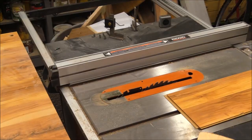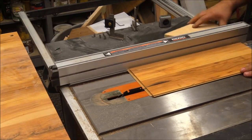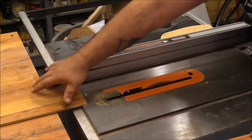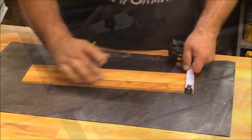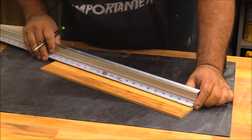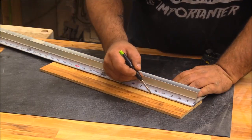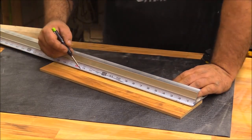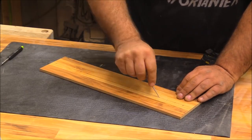For the plate I'm using flooring — that Pergo-style stuff you get at one of the big box stores. I like using it because it's fairly rigid and pretty tough, so it works out really well for plates, patterns, and that sort of thing. Whenever you cut this stuff you want to be wearing a dust mask or have really good dust collection, or both.